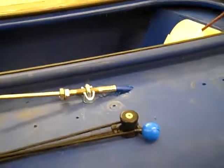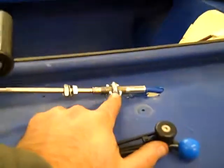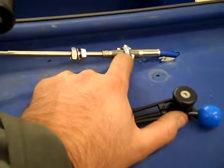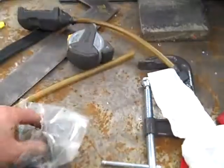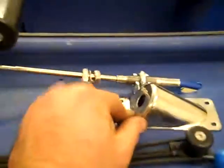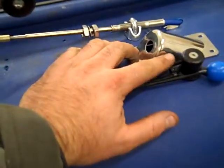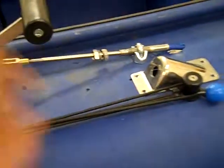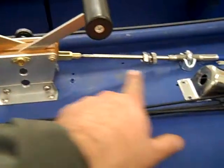This is the first fit and I think it's about the tenth fit today. I think this is the final setup. I went with a wire rope holder in the hole here, passed through. I had a nice clean hole and a different cover I was using — bought it from Teleflex. I was going to try to run two of those, one for the throttle cable and one for the reverse bucket. But as you can see, the angle goes up, and I thought there would be more flex on the cable so I could pull it down flat.